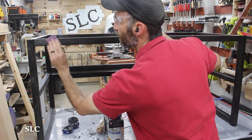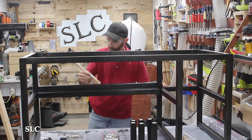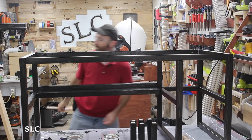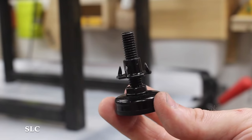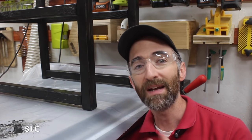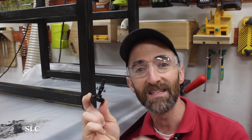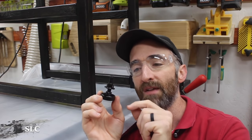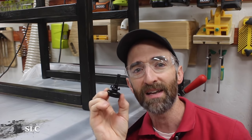If you've ever used a finishing coat on a wood project, you'll know that it raises the grain and needs to be lightly sanded with 400-grit paper before adding a second coat — otherwise your project will feel like sandpaper. While I had the polyurethane out, I added a nice coat to the desktop and shelves. When making furniture, you normally have four contact points on the floor — you need to make sure those are even. In my case I have six, which makes it nearly impossible to get perfectly level, so I purchased some adjustable levelers for the bottom of each leg. These needed to be trimmed — about a half to three-quarters of an inch — because of the pocket screw depth.